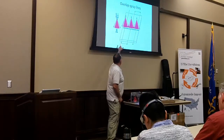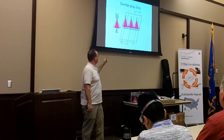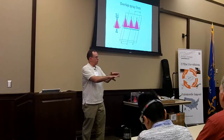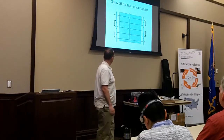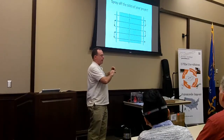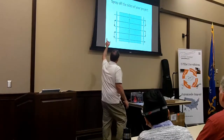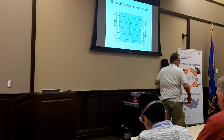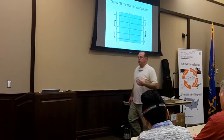When you spray, you want to get the fan pattern perpendicular to your direction of travel, and overlap your fan pattern a little bit so that the overlapping paths have a chance to flow together. Spray off the sides of your project — start and stop off the sides — because when you pull the trigger and let go, there can be an irregular flow of paint with larger droplets and spatter. I encourage students to pretend you're a robot. The more mechanical you can be about this, the better your chances of getting a good result.